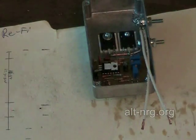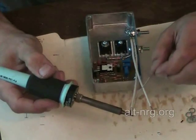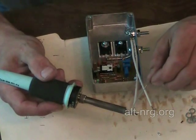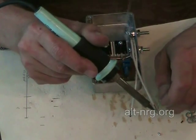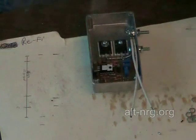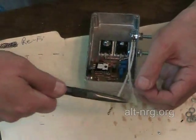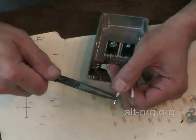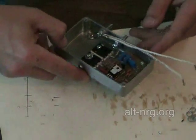Now I'm going to pre-tin the ends of the R12s that will connect to the sources of my power MOSFETs, and then I'm going to pre-form them by bending them straight downward. I load up the solder pretty heavily on the ends of these because I'm just going to want to tack solder them to the source terminals of the power MOSFETs, and that will provide enough solder to flow when I apply the heat. With my needle-nose pliers, I've bent those straight down, and now I'm just going to loop these around.